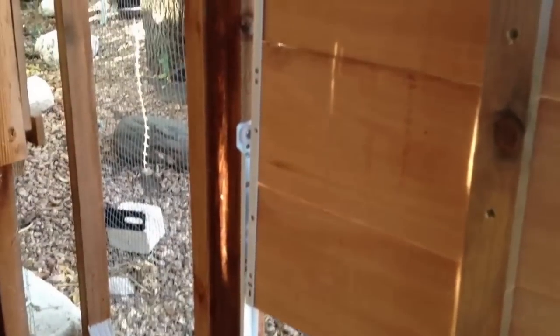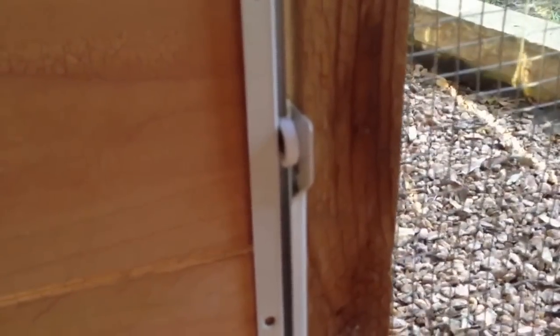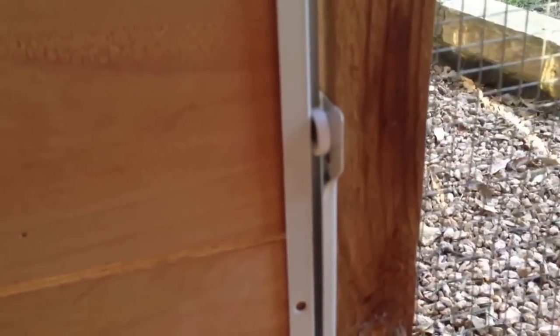The other difference is that instead of having the wooden door slide through a wooden channel, I got these cheap cabinet slides from Lowe's — you can also get them at Home Depot or wherever. They call them the European kind, and they just have nylon wheels so they work if they get wet. If you get the kind that have bearings in them, you risk getting dirt and grime and rust in those bearings.